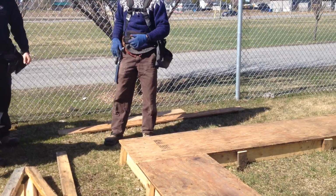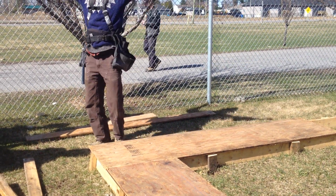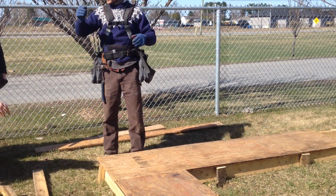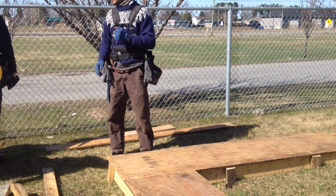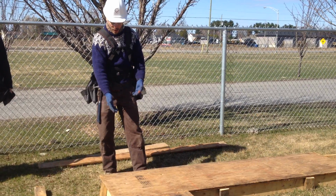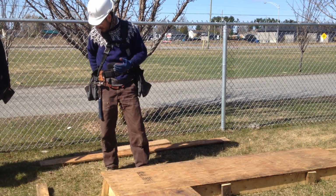But in reality, how would that be dictated? We would be at the bottom of the hole, and there would be string lines, and we would drop a plumb up to here and one over there, make marks, chalk across, right? But we don't have that set up. We're only building a corner wall. We're going to go off a line, which is not completely wrong.